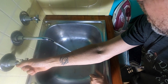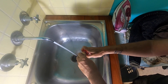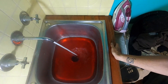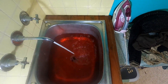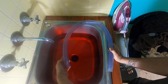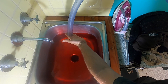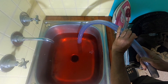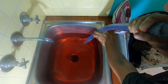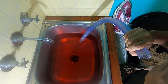Let's fill the sink up and I'll add a bit of dye just to make it more visible for you. If you imagine this pipe is the boat's raw water system from inlet to outlet — even though this would be the skin of the boat — that's still below the water line. So it'll self-prime to the water line as soon as you open the sea cock. Then as the pump draws, you see the water come up the pipe.